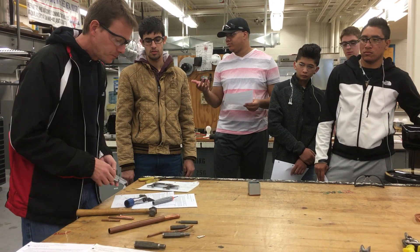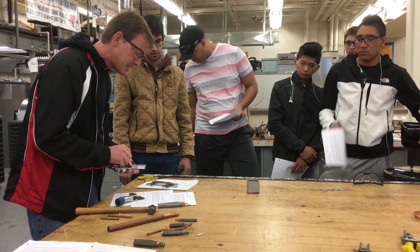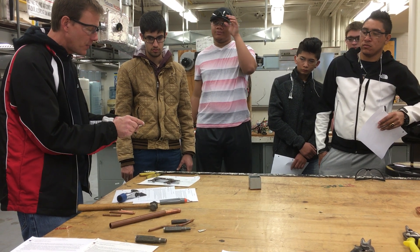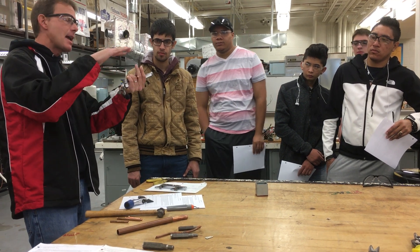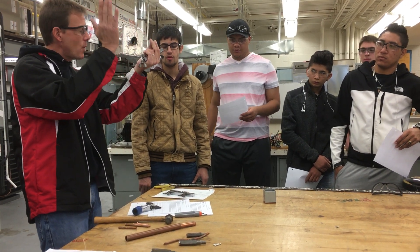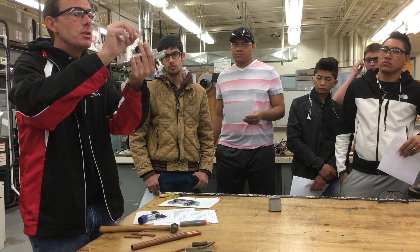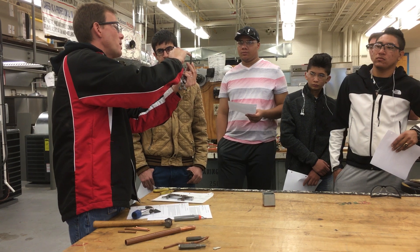Once you get your piece cut, place the quarter-inch copper tubing in the flare block so it extends up a distance slightly more than the length of the swage shoulder. This is the shoulder right here. We can also use the tip — the front part all the way up to where the bevel starts. There's going to be a bevel or chamfer — same thing — at 45 degrees, almost like a flare but going the other way, spreading out. We're going to go to the top right there where my finger is — that's the shoulder, and this is what I'm going to use as my height gauge. I could also use the distance between the octagon part of the swage handle and this part of the shoulder.